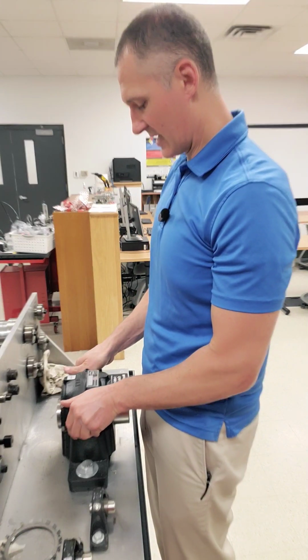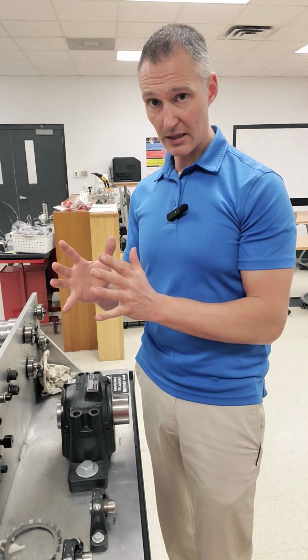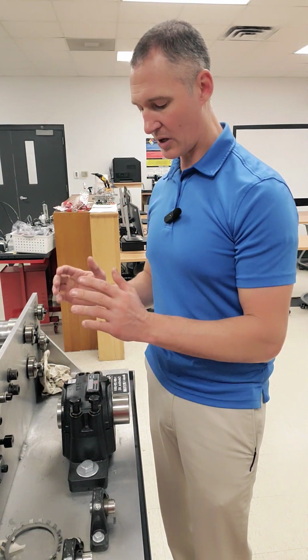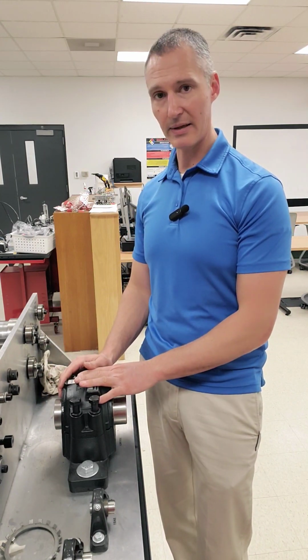So finishing the installation is basically putting the cap on. The cap actually has pins in there. The pins fall in, that way everything can line up perfectly. And then, of course, there is assembling of the bolts, okay? And all the bolts will go in and get torqued down to the manufacturer's specifications. And again, that's right there how you mount that particular bearing.